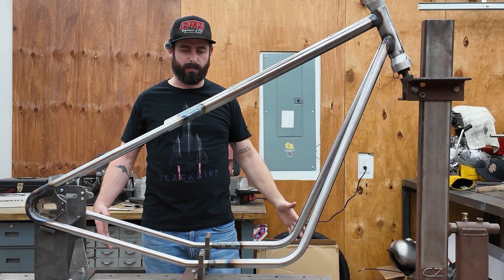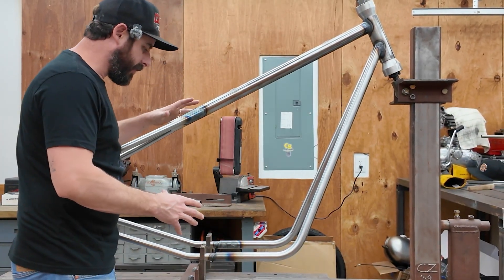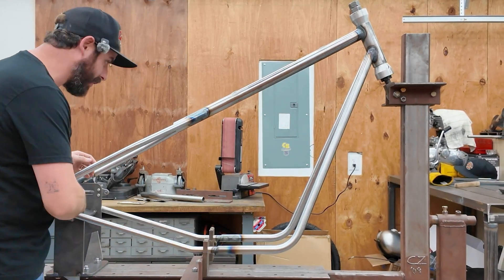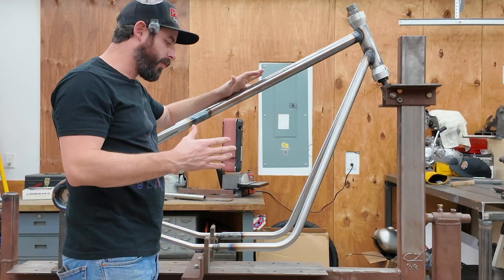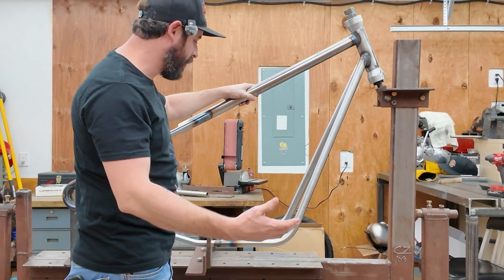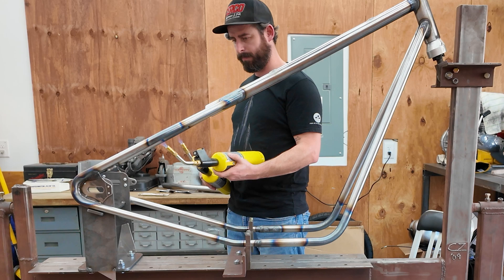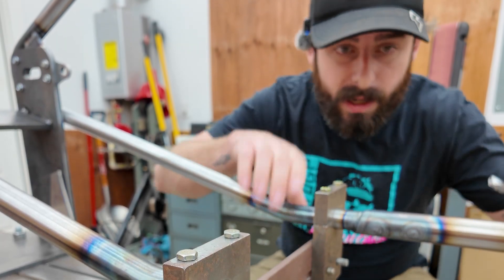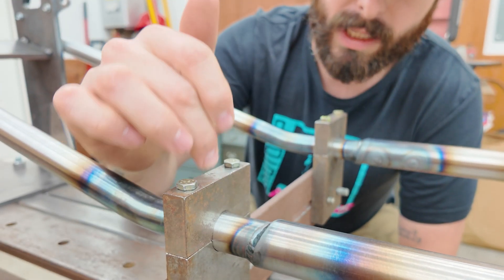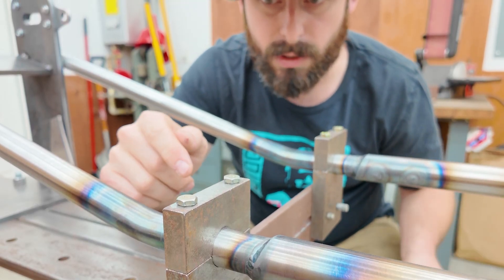The camera shut off and I was in the zone and I welded it all up. But since I've welded it up, there have been some heating forces that pull all of these things in various directions. They're locked into position, but there is some tension on all of these positions due to welding. So I'm going to stress relieve this frame — it's just mild steel, it's not going to hurt it. What I do is heat it up here and here and here, and that should let the metal settle. It's all cooled off, and I realized I didn't capture when I released these clamps. There was a little bit of lift in here and I'm hoping to have reduced that with the heating of these tubes.